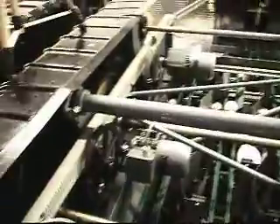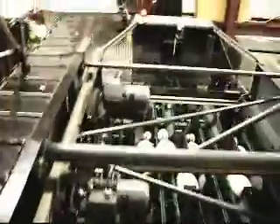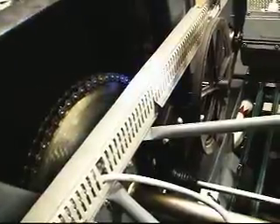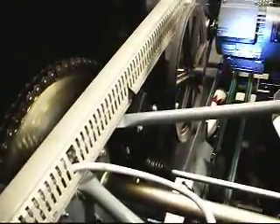This is a new one for myself and for everybody, so I'm going to let you know what I found out so far. The C switch was expected but not found only because there was no rotation in this shaft — I'm highlighting it at the bottom of your screen. That shaft was not rotating, and it's on a big chain drive wheel which goes back to the front table motor.